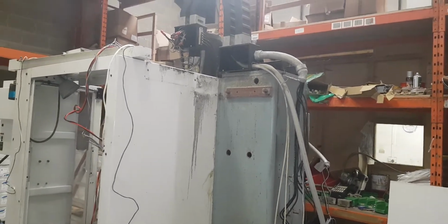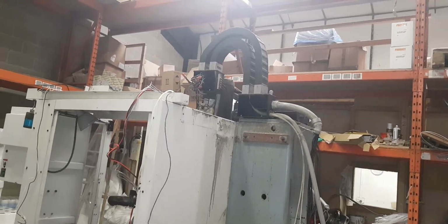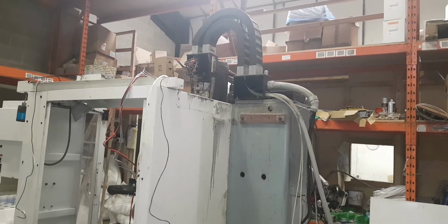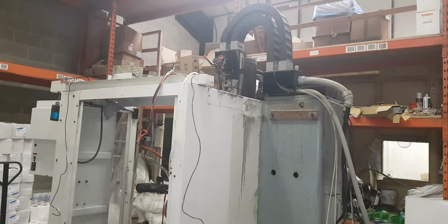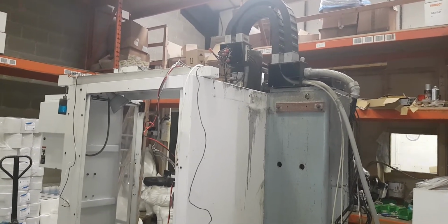And when it's done, like I say, it will all be single phase, because your man in his garage is going to want single phase. And because I'm using the AC servos and stuff, they're all single phase anyway. It only left the spindle that wasn't. So it's a bit of a no-brainer really to do that.